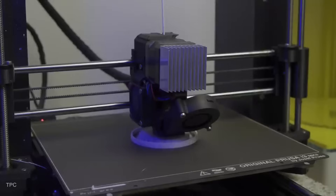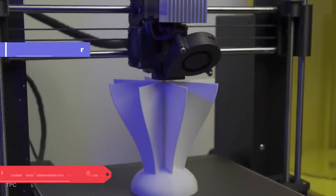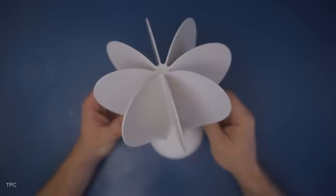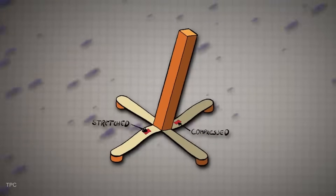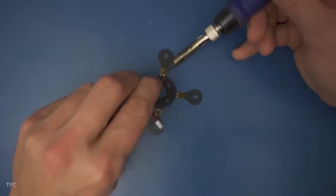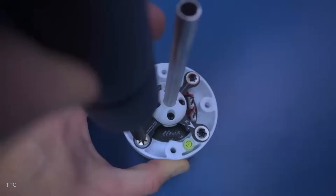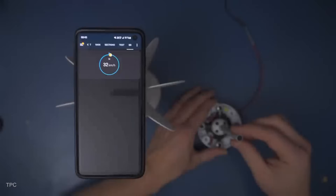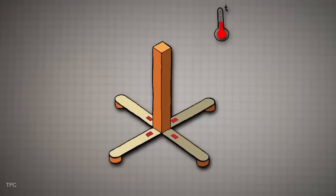Number nine: Sebastian made an innovative wind gauge design which does not include any moving parts. There are no spinning cups or wobbly arrows — just a clever way to measure wind speed and direction more reliably. This device uses strain gauges, small sensors that detect changes in mechanical stress. By attaching these to a specially designed structure that bends under wind pressure, the gauge captures data without relying on intricate mechanics.